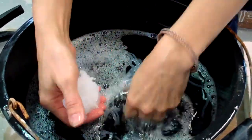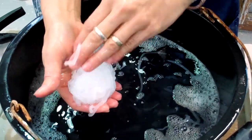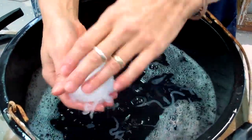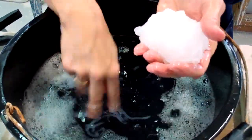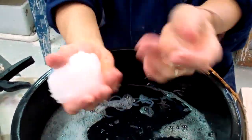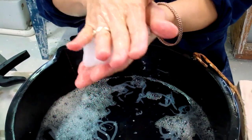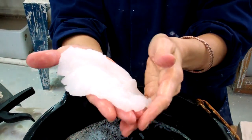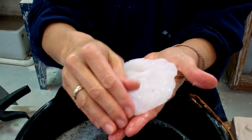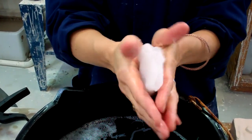But if you are making a mold with it, that's an asset — if you're not finished or you run out, you just go out and buy more sealant the next day, add it on and it just sticks. So now it's like putty and it's starting to set. You can apply it to anything and this is your mold material. You can make a complete mold, let it set, cut it open with a knife, pin it back together with dress pins, seal it with silicon, and you've got a mold.